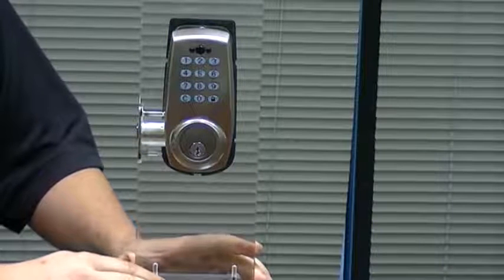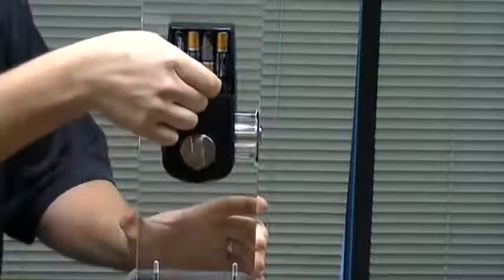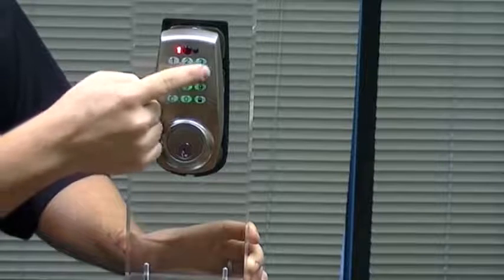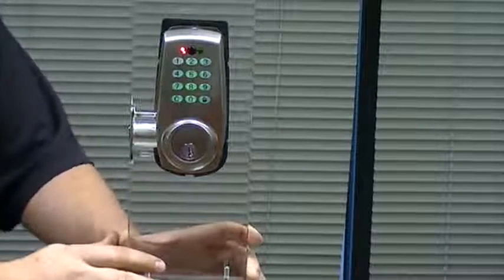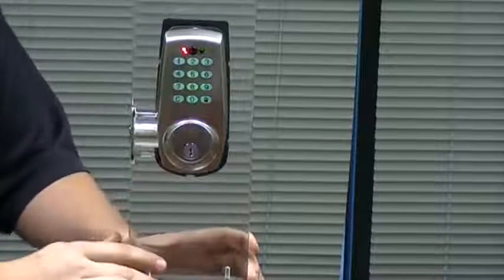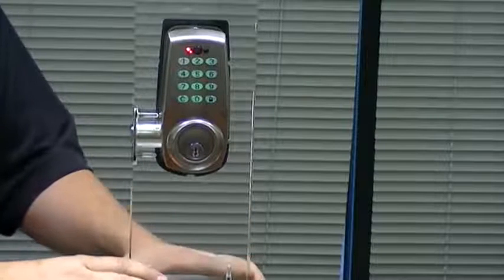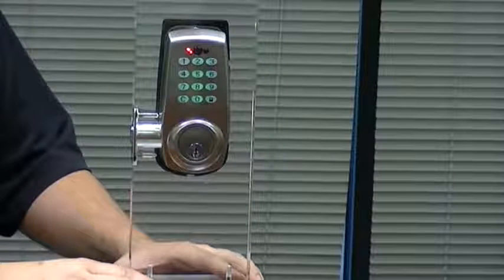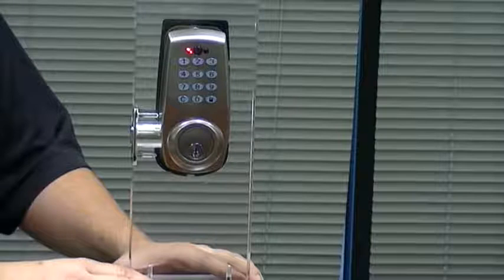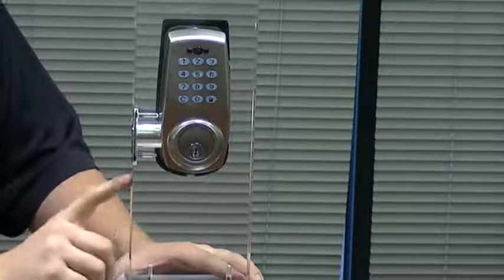Next, mute mode. Press and hold the set button for 2 seconds until it beeps, and then let it go. Enter your programming code, followed by the lock button. Enter 60LOCK. Enter 0LOCK to mute the unit. Wait until the unit times out and then test the unit. The setting only mutes the unit out of programming mode. It will still beep during programming mode.